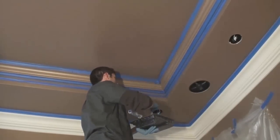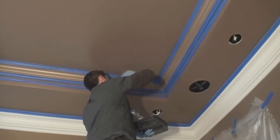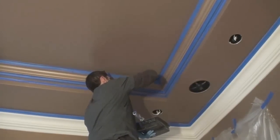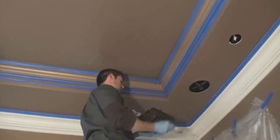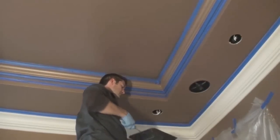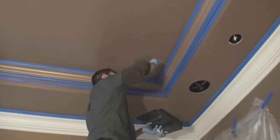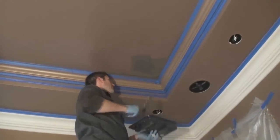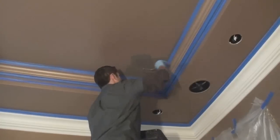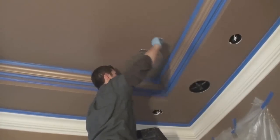I'm just going to go, just like I'm painting — I don't want to build it up real thick on that tape edge, I just want to get it covered. Then I take my roller and I'm just going to start rolling over that surface. I'm not trying to keep it on real thick, and I'm trying to create a lot of random movement — constantly moving this roller around.